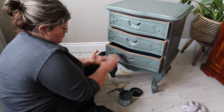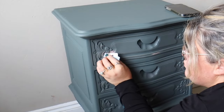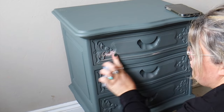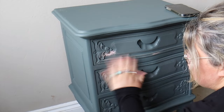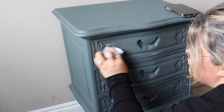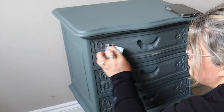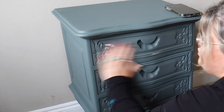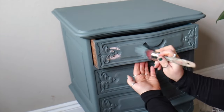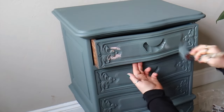Although this is covering in one coat, I am going to do two. It's got quite a bit of detail on the front and I'm just sanding a little bit of that detail to remove a paint drip. If you get any unwanted texture and you're going for a super smooth finish, don't try to fix it when the paint is wet or trying to dry. Let it dry down completely, get some sandpaper or a sanding sponge, sand it smooth, and then re-coat — because if you try to touch it up while it's wet you'll just create more texture.